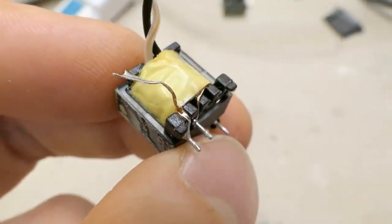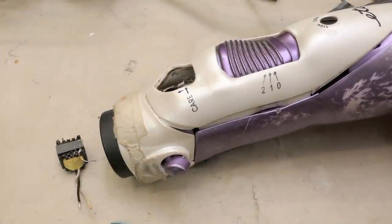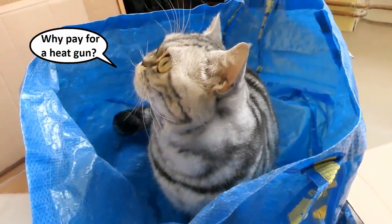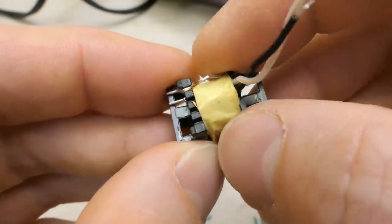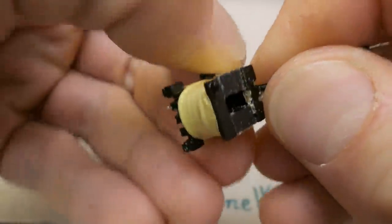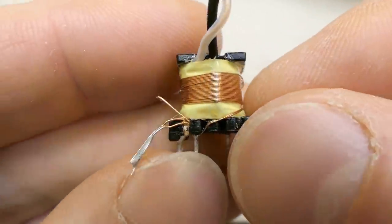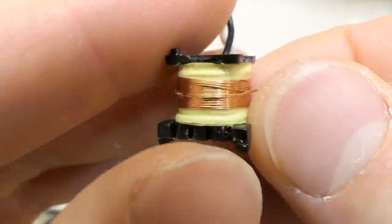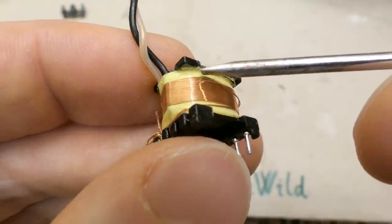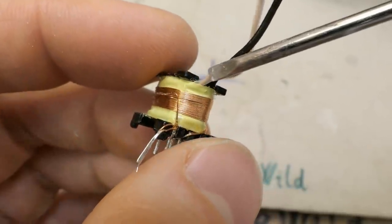This wire is connected to the negative rail of the primary side. Now let's use a heat gun to soften the resin and remove the ferrite core. The core opens and it has an air gap in the middle because it's a flyback switching power supply. Then there is some sticky tape — removing it reveals several layers and a winding, which is probably the auxiliary. It's quite well spaced from the edges, basically just in the middle with a big gap on each side, spacing it from the edges of the tape so it can't fall through and touch the other windings.